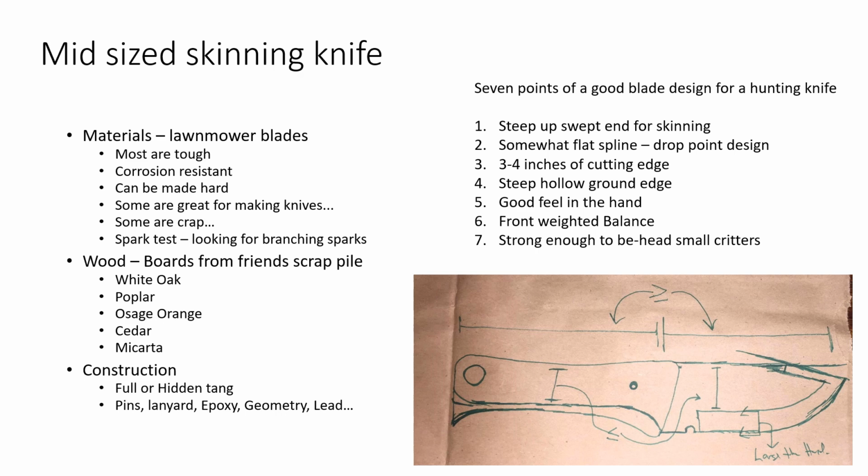I'm going to put one pin in the front, going to put a big old lanyard. I've got a 1/2 inch aluminum tube in the back. I like to cut it in sections. It makes a pretty respectable lanyard hole. You can't maybe make it out here on this, but my intent is to have a slight sort of a depression on that top line of the handle. I want it to come in ever so slightly. I'll simply grind that out.